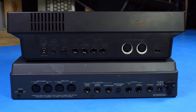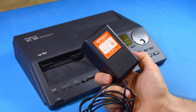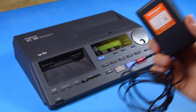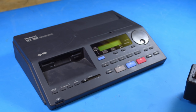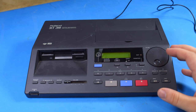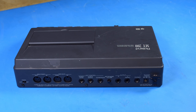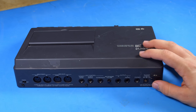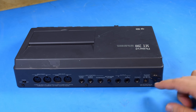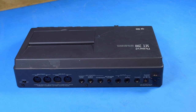Unlike the Yamaha, where I was able to test it out before I did this video, the Roland actually doesn't work. Like most music devices, it uses a 9-volt DC power supply but with a negative center. I did get this with the correct original power supply, which hopefully means the problem isn't that someone plugged in the wrong supply. However, with the original power supply connected, it does nothing — so it seems like a global failure, because there's absolutely nothing going on with the device. I just picked this up yesterday, but I did open it up and have a pretty good idea what the problem is. Let me open it up again so I can show you what I'm looking at as the prime suspect.